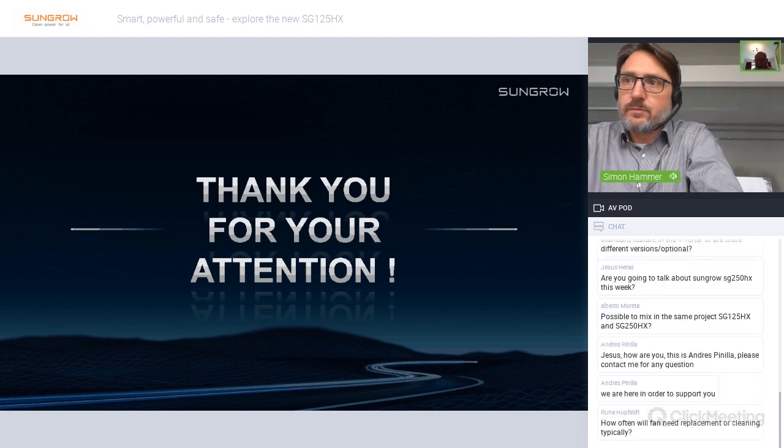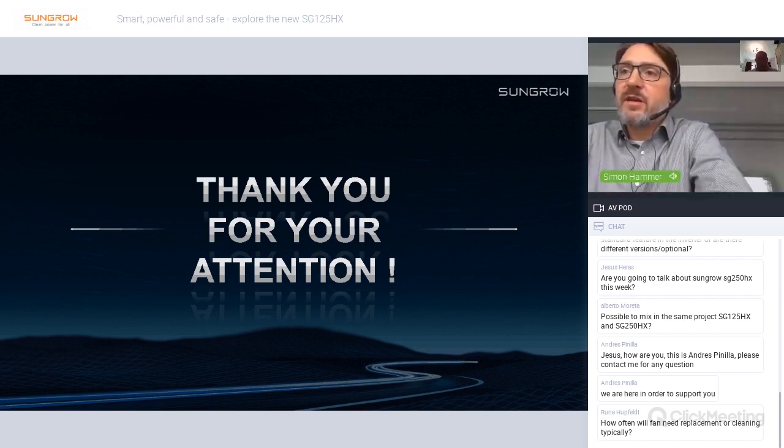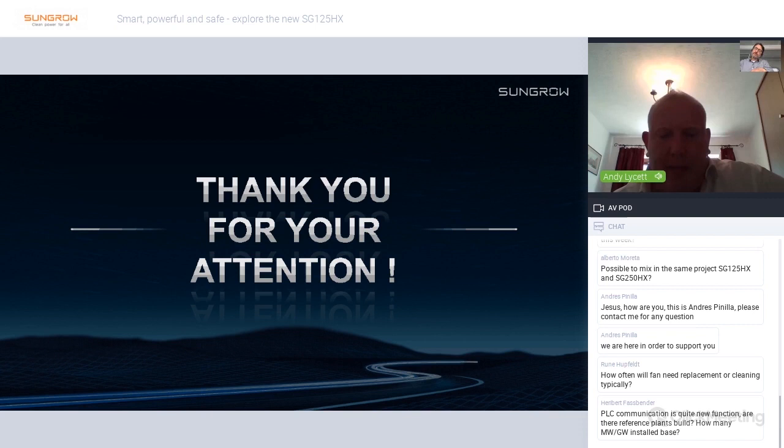I believe that's most of the questions that have come in. Oh no, we had a last-moment question from Renee. How often will the fan need replacing or cleaning, typically? Basically, the fans are tested and designed for a 25-year lifetime. So normally nothing should happen to the fan during the lifetime. The cleaning is a question you cannot simply answer. This depends on the installation conditions. If you have a very dusty, polluted or sandy area, you have to do it more often. So this depends. Okay, so very much dependent on the system and the location, environmental factors, etc.